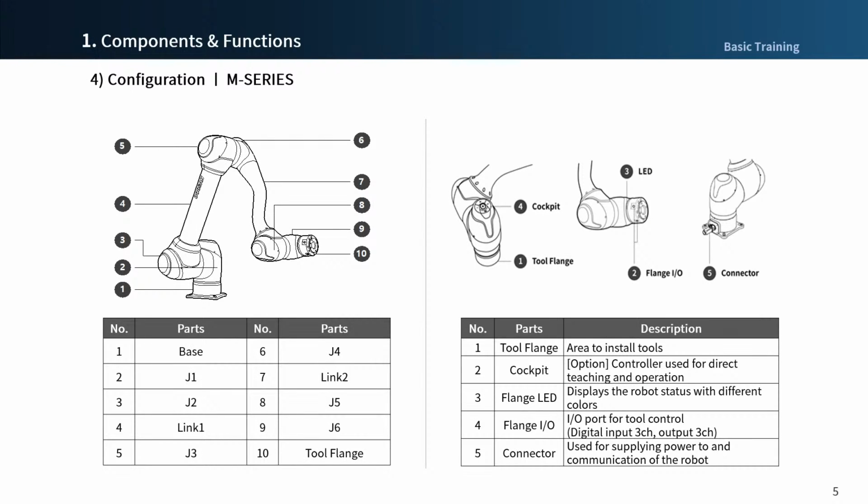The following is the robot configuration, its part names and functions. Although not in the slide data prior to the introduction, let me briefly explain the inside of the joints module. There is an encoder that measures the rotational number of motors to read the angles of the joints, a motor that rotates the axis by power, a decelerator harmonic drive that reduces the high speed and low torque of the motor and converts it into low speed and high torque, and finally, an electric brake that secures the joint. Let's check the name of each part of the robot in the next video.